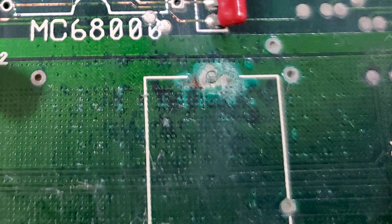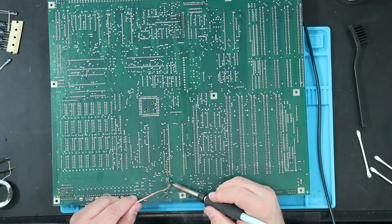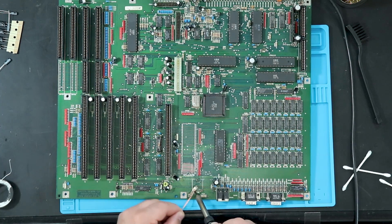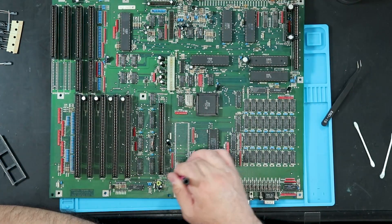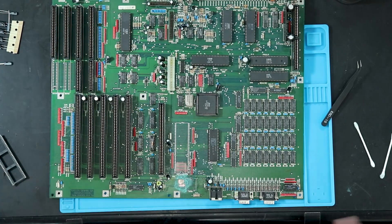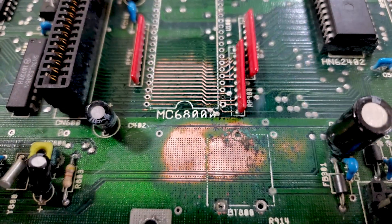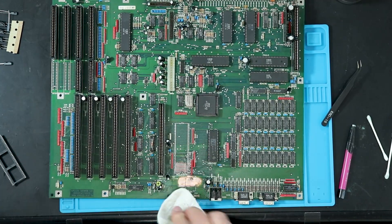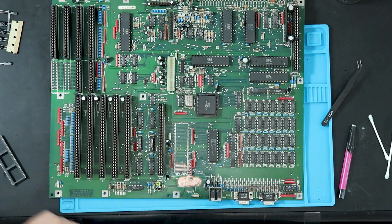The damaged areas need to have the solder mask removed to expose the copper beneath — the corrosion has gotten under the solder mask, as seen by these dark spots. They all have to be exposed and cleaned to prevent the corrosion from continuing to do damage. The solder mask around the battery area also needs to be removed, and the battery pins are in the way, so they have to go. The solder mask removal was a bit laborious; after about an hour it's looking pretty good. I'll remove all the caps now to get the rest of the removals complete and be ready to build things up.